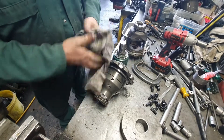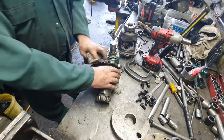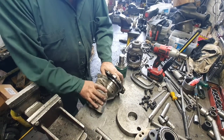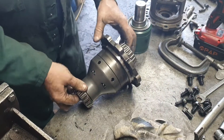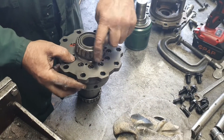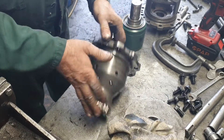Through the center line there's no bolt-on journals. All the bolt-on journal ones disintegrate - the spigots are made sometimes about 20 thou smaller, the male part rotating into the carrier counterbore. But this one doesn't have that. 11 bolts hold it together - one, two, three, four, five, six, seven, eight, nine, ten, eleven.